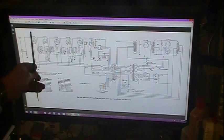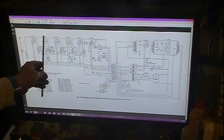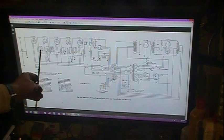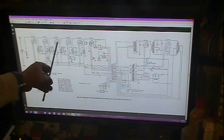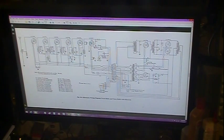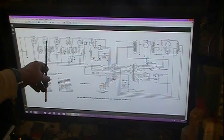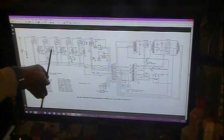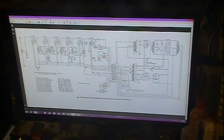What's important about that is, then you can plug the adapter in and actually use the tube that's in the radio that's going to be in it running, when it's operating. So you get to use each stage tube that actually would go in that stage without having to damage the tube. Well, if it needs neutralization, that's what I'm going to do. I'm going to make up the adapter, and that way I can use the tubes that are in here. I'm not about ready to destroy a good 26 tube to do this. If there was no other way of doing it, I'd figure out something. If nothing else, just unsolder the one filament lead right there on each one. It'd take a little longer, but I'd do that. Or put some heat shrink tubing over the pin or something.